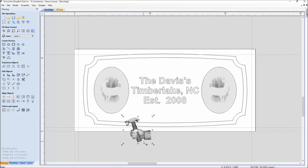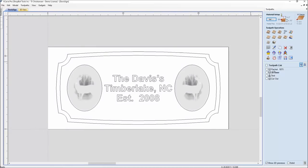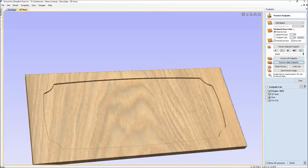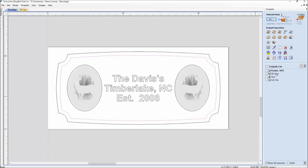You can also use horizontal mirroring — mirror it right to left or left to right — resize and rotate. I brought in clip art left and right mirrored, brought in the text, and then when we get into the tool pathing side there are a few options for creating signs like this. The first toolpath done was a pocket — a cut depth to 3/16 of an inch. That pocket gives the depth, and the text and 3D clip art are carved into that pocket.